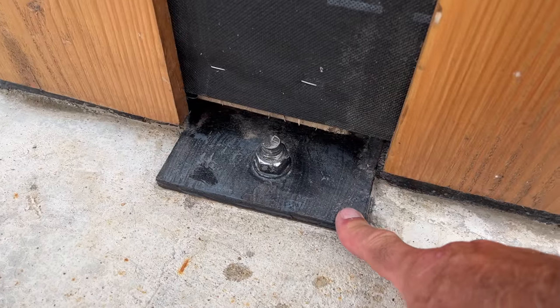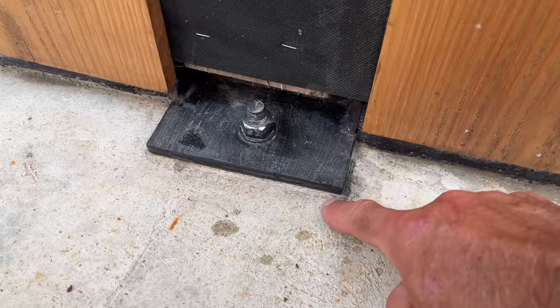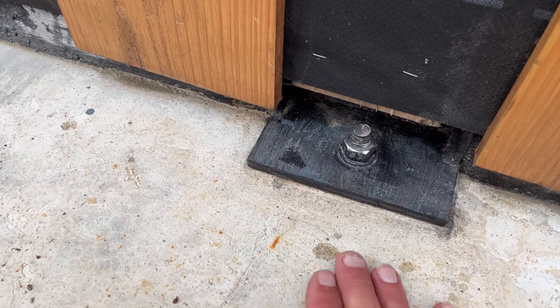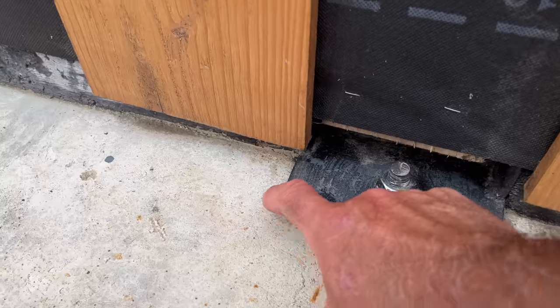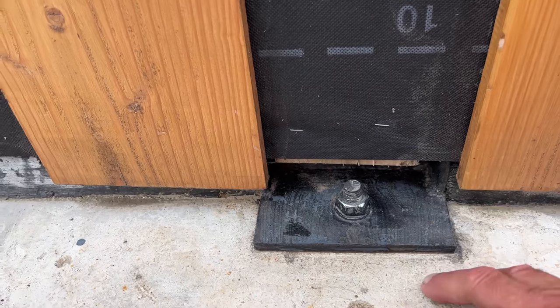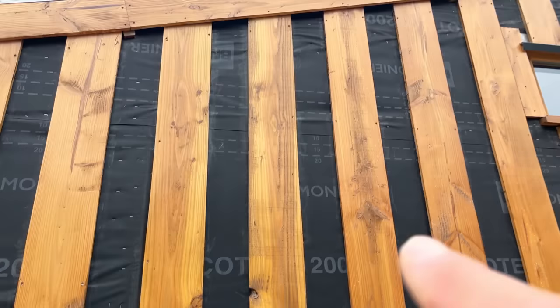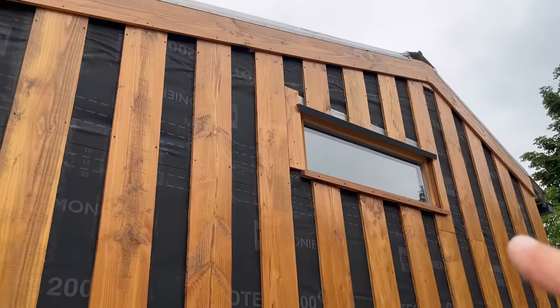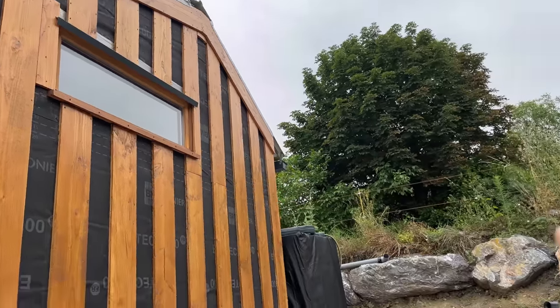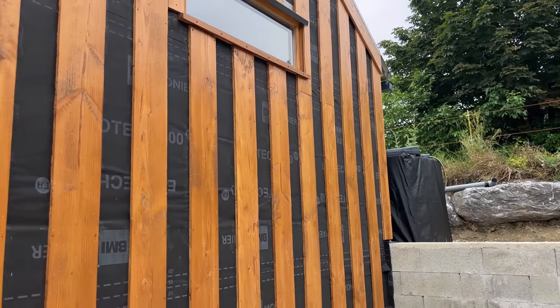I'm now going to go and seal around the base of the steel uprights of the garage because we've got a little bit of rain leakage in there. Here is the base of the steel upright — I haven't actually sealed all of this. It's sealed along the concrete but we didn't seal around this edge, so water has been going underneath there and into the garage — not a lot, but just annoyingly enough. This will all be under cover once we get another little roof we're putting along here and down — this is where the tractor and mini digger and everything will be stored.